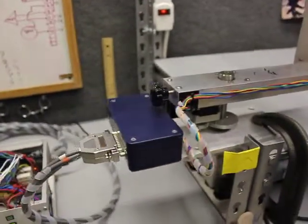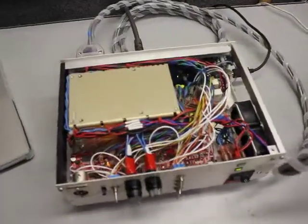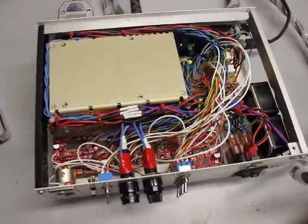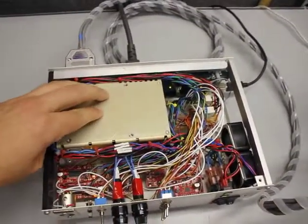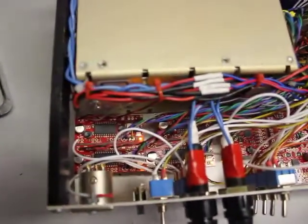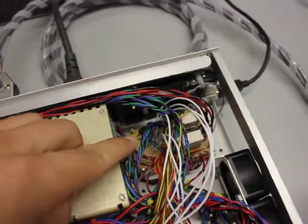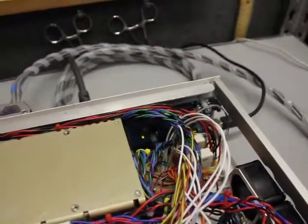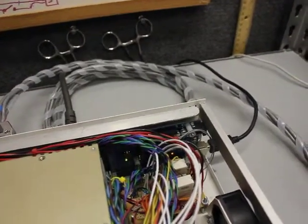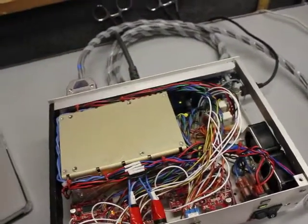Taking a step further back, you've got a cable box that moves all your signals down into your motor control box and interface box right here. Inside here you've got your power supplies, and all those little red boards hidden in the back are your motor control boards. You've got your main wiring board hidden down inside there and then your interface board — you can see a little green light back there — which is the ambassador between all your motor control pieces and the computer.